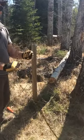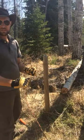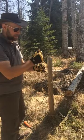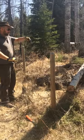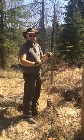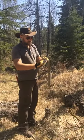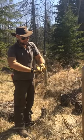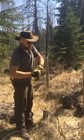Next, you want to take your number nine black fencing wire. You can also use the barbless twin wire. Go through here and then come along to find your other end of your wire. As you can see, I've prepared that in the same way — folded back and twisted. The reason we go through from the other end is because it lets you know how much wire you need; it's less wasteful. Then we come to this end and just fold that over and twist three times to make a connection there.